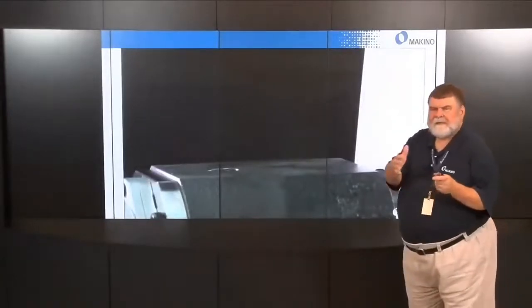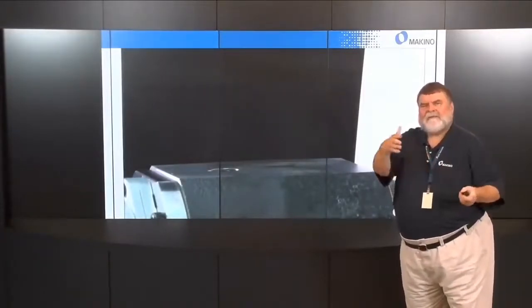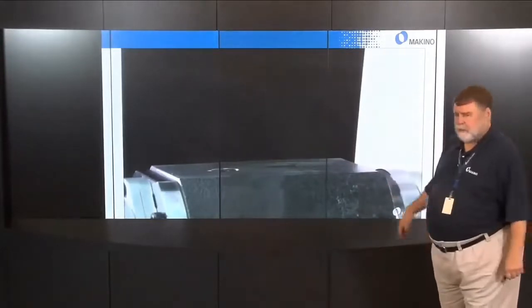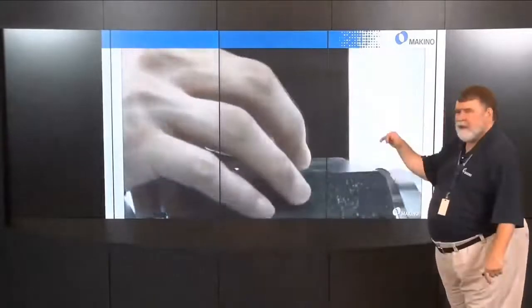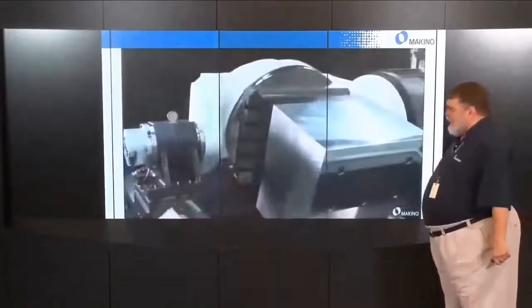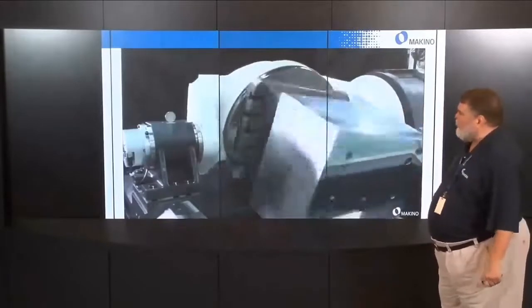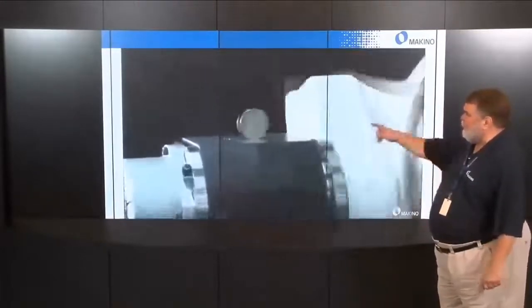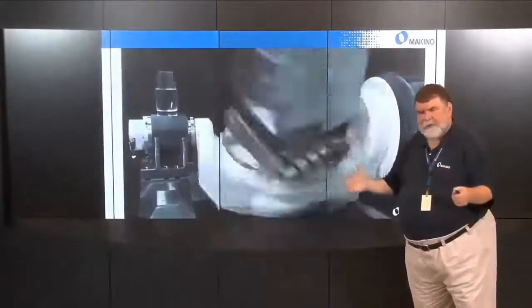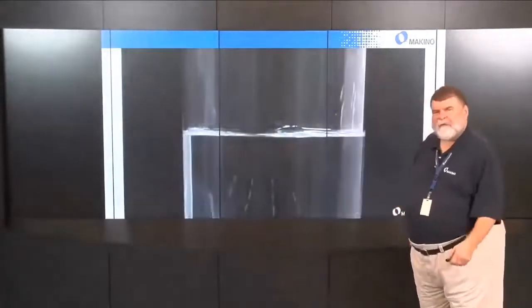You have distance, velocity (rate of change of distance), acceleration (rate of change of velocity), and jerk — the third derivative, the rate of change of acceleration. Jerk is something you want to avoid on machine tools. We're showing a video where someone stands a coin on its edge, and in the distance you see the A and C axes in motion — 150 RPM on C and 100 RPM on A with a full 500-pound pallet load. That coin never moved, demonstrating the outstanding control of motion, positioning accuracies, repeatabilities, surface finishes, and blending.